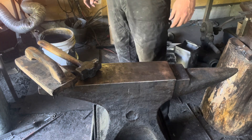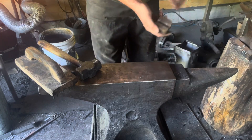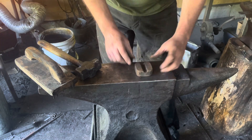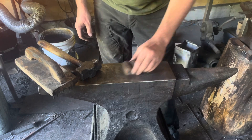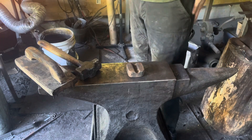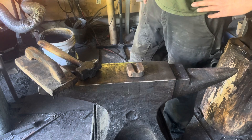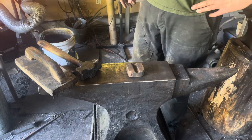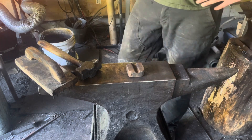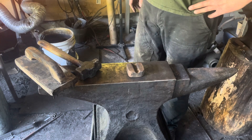Some light blows to get it started, and then we'll cinch up the weld. It helps to have some sort of a block to keep things contained. I've actually got a swage block on the stand behind the camera, but so you guys can see what's going on I'm going to use this little block. One thing I noticed — and I don't recall if it's the same with borax — but at least with the Iron Mountain flux, the flame in the fire actually changes to a dark orange right at the time you're ready to forge weld. I don't know if that's particular to this flux or if borax does that. Some people look for the little sparks showing up in the flame — to me that's a little bit too hot, I like it a little cooler than that.